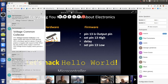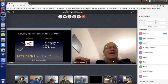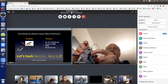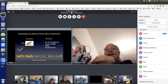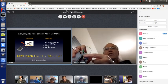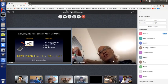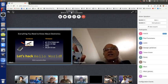So it's a little bit weird though, because, so this is an aside. Don't worry about if this makes sense or not for everybody. There's certain parts of the microcontroller chip here, which you have to program in a special way, and those are called fuse bits. And that reconfigures some of the hardware to be a little bit different. So you have to tell it whether you want the microcontroller to use its internal 8 megahertz oscillator, or there's also an internal 125 kilohertz, much, much slower oscillator, or if you want to use a ceramic resonator or a crystal.